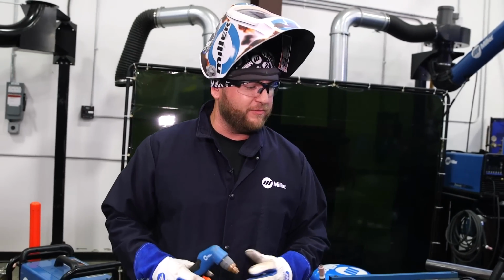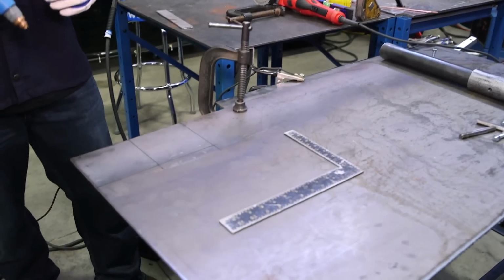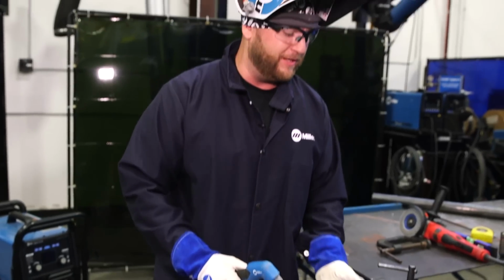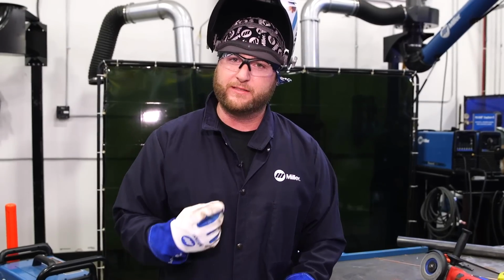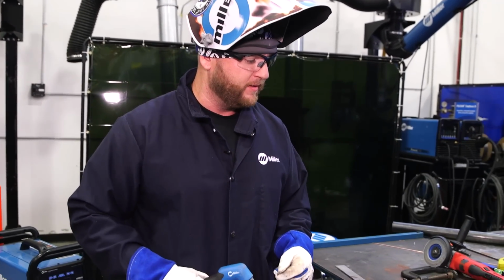When you do this kind of stuff, as basic as it might seem, we're starting with a large piece of steel here. So use that to your advantage. Don't cut the small square out first and you're left with this tiny piece you're trying to hang on the side of your table to finish your cut. Make all of your small cuts first and make your last cut the rip to get 2 plates out of 1 cut, okay? So it's just like order of operations. Think of it as a bigger picture, all right?